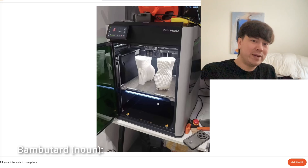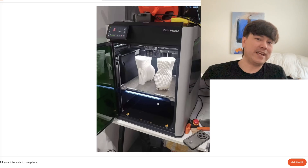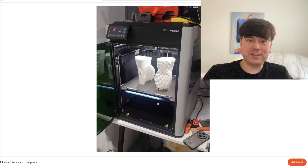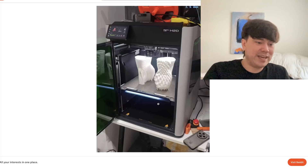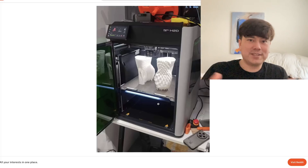Something you might need to know is that even after you've laser cut some things, they can continue to off-gas. For example, with acrylic — after you've cut it, you don't just turn the machine off and call it done. You actually have to continue ventilating those parts because they're going to keep releasing toxic fumes into the air even after you've completed all your laser cutting.